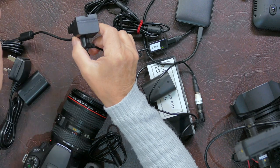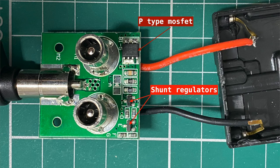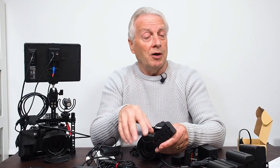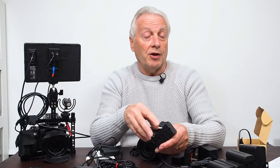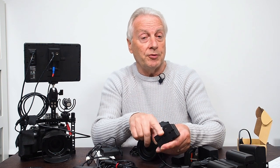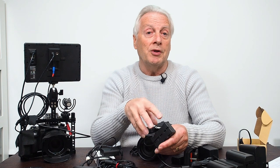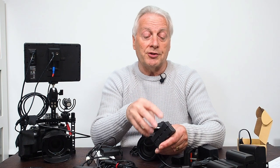The beauty of this device is that inside there's an electronic circuit with a power MOSFET and two shunt regulators. The shunt regulators are there to protect the external equipment — one is set to provide under-voltage protection and one for over-voltage protection. So if your wall supply drops below 6.4 volts it will cut power to the connected peripheral, or if it goes over 9.4 volts it will also cut power, protecting whatever device you have connected.